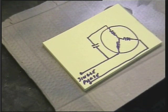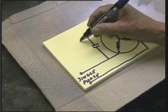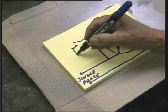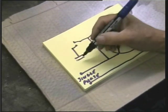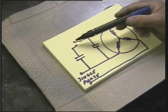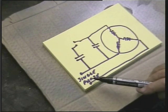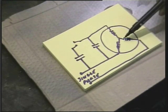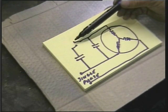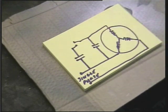So what we want is a capacitor that has high capacitance just for the first second of starting, and low capacitance for actually running. There is no such single capacitor capable of doing that. But what we can do is put a switch in here with another capacitor at a higher value, so that we hold this switch down, plug the motor into the mains, and within a second or two the motor has shot up to speed, in which case we let this switch open. The motor is now happily running on the smaller value capacitor.